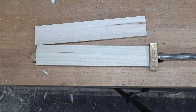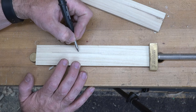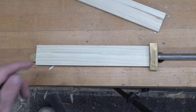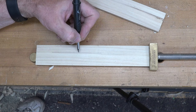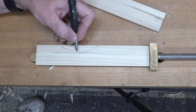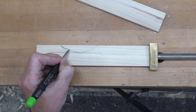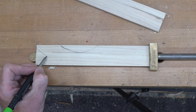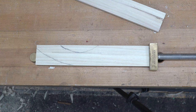You can use the pattern from the website — cut as per the pattern, make templates, adhere it to your wood — but I'm just going to freehand mark this. The nine-sixteenths is the bottom of our divot on our sled. I'll roughly mark the center and sketch the curve — it doesn't have to be perfect. We'll also slope this down at the front of the sled, ending right at our three-inch mark. That is essentially the shape of our sled.